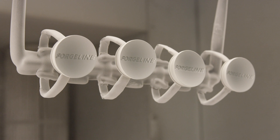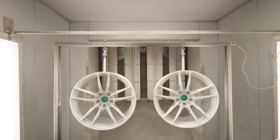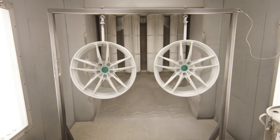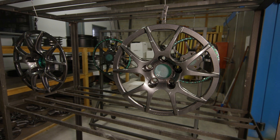The powder coating department is going to take it from there and they're going to wash it again. It's been washed once from the grinding room, and they're going to wash it again to make sure there are no contaminants anywhere on the surface of the product. They're going to pick that particular color and they'll do them in batches — any particular day we could do five or six different colors because we're making wheels basically four at a time.